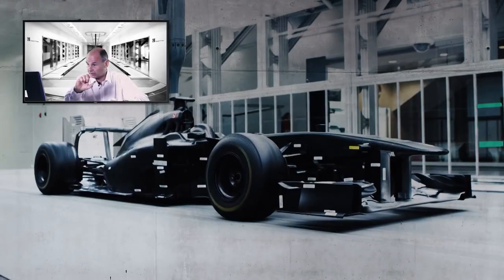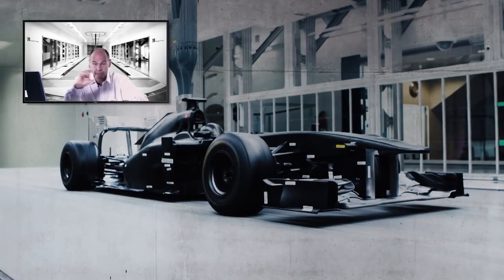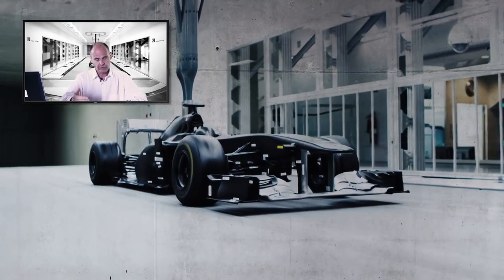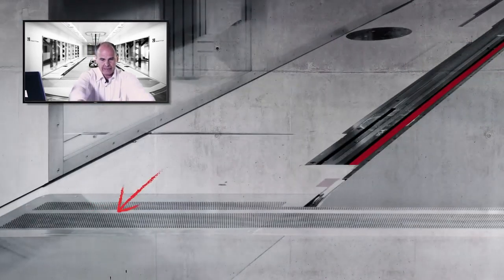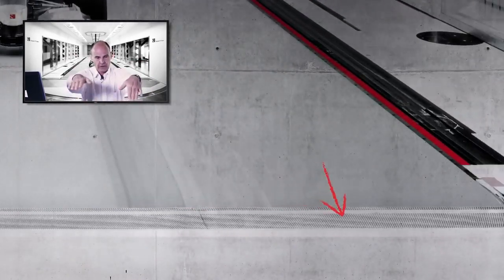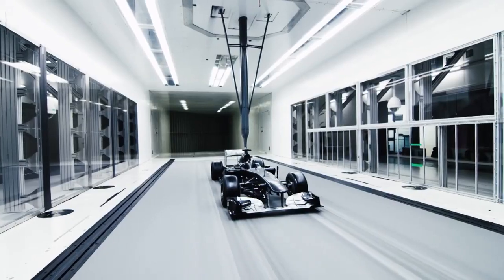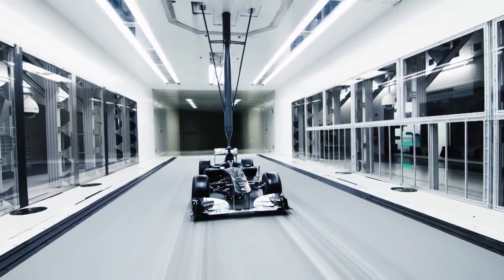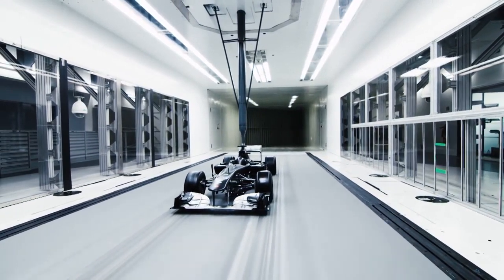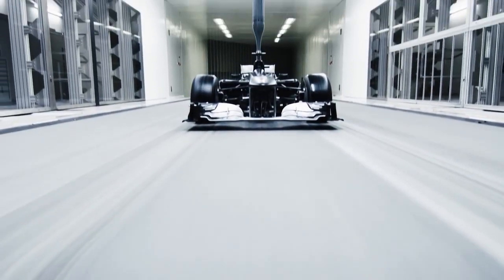And typically speaking, in a decent sized wind tunnel, it's going to be 40, 50 millimeters, something of that sort, if your wind tunnel is well designed. You can also just put a patch in front of the working section with holes in it and just suck air through that patch, which will draw air down towards it and speed up the airflow near the surface. Then just behind these systems you put your moving ground plane, which is moved at a speed synchronized to the airspeed, and once you start moving onto your belt, then you no longer have growth of the boundary layer.